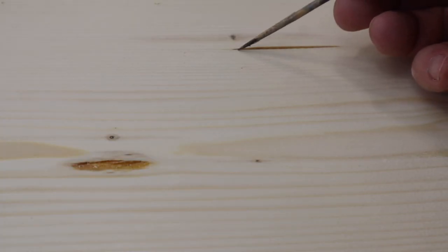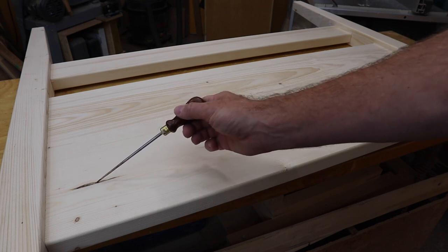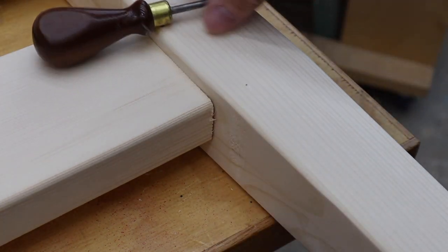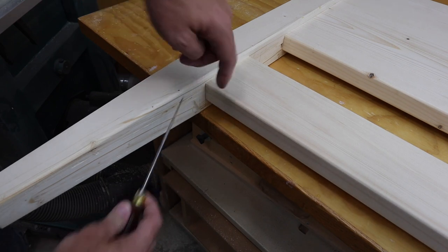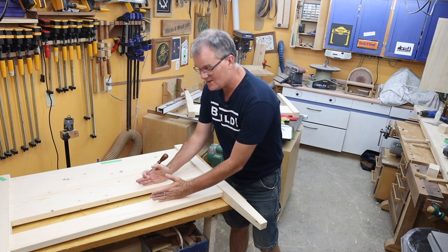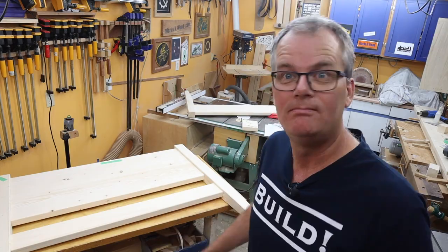The reason I had to flip it over quickly is that on the back of the headboard there are one, two sap pockets that are actually recessed into the wood, and a couple of knots where the wood is just not smooth. I could fill all these with epoxy since it's going to be painted. Also, there's a gap on the lower headboard board — I ran the taper just a bit too high on one side; the taper was supposed to stop about a half inch below the joint. But the mattress will cover it and it'll be tucked against the wall, so nobody's ever going to see it — full disclosure, made a mistake, oops.